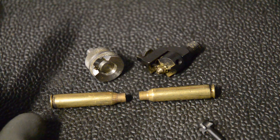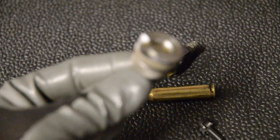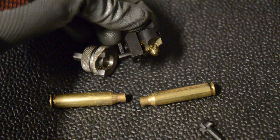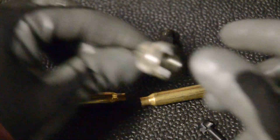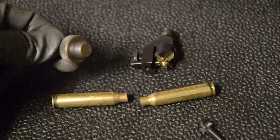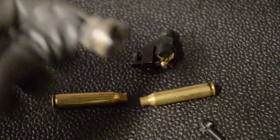To do this you'll need three things. You'll need a drill press with a vise. You'll need this guy from Lee, which is a shell holder with a little stud on it. And then you'll need this three-way cutter from RCBS. This consists of a shell holder — you can get this in different sizes — and then this guy goes in the vise on your drill press.